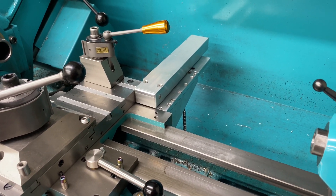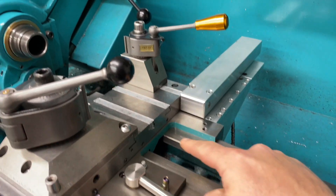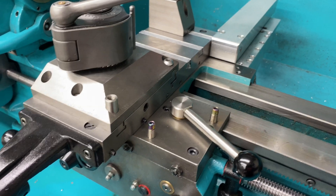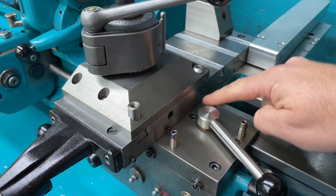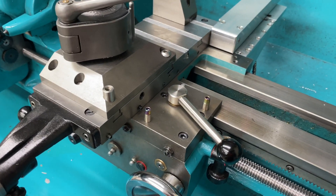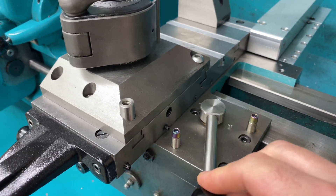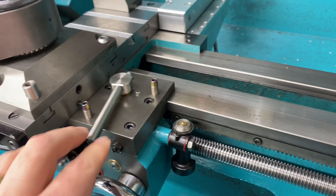As I mentioned previously in the first part of this video, the scale for the DRO was in the way here — it obstructed the tailstock. It doesn't anymore; I can get the tailstock all the way in just like a normal Myford. The other thing was the bracket for the scale was getting in the way when winding the cross slide outwards. There's a screw hole for the bracket that used to clash with the clamping lever for the saddle, which was a pain.